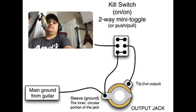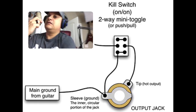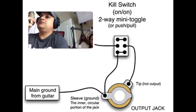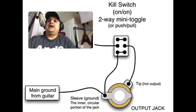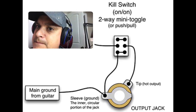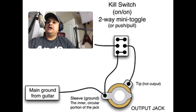Of course I put that in the wrong place. So what you have here is, because I changed that. Okay, see the switch that I covered up with my face? The wire that goes to my face actually goes to the volume pot. Okay, so that's going to be the middle lug of the master volume. So that's where that's going to go.